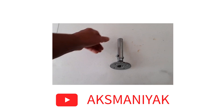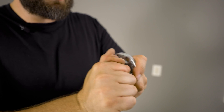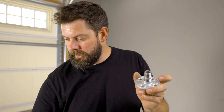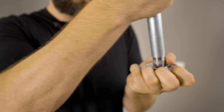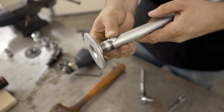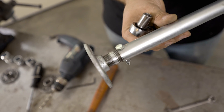Number four is a community hack shared by Axel in a video — he's got a YouTube channel, we'll link that, definitely check it out. What he did is take a slightly smaller threaded pipe flange, the half-inch version, and then he got a steel pipe nipple — a half-inch galvanized pipe — and put it on the inside of three-quarter-inch EMT. You can screw it down pretty good, pretty far. He gave it a little more of a tap and hammered it in. Then he drilled through both the conduit and the steel nipple and put in a pin right across. Really cool idea — I hadn't seen that before and I think it works great.